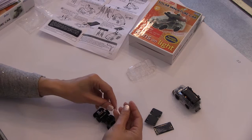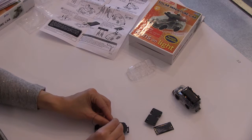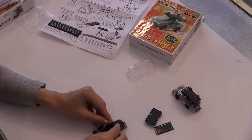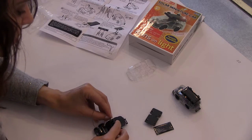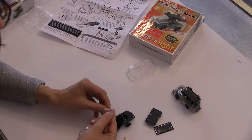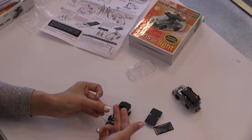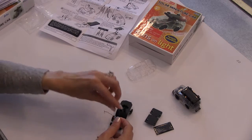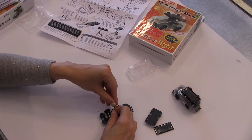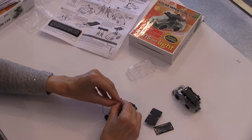So you're going to take the clip, and the longer end is going to go in the center, and they just go down into these pillars. But the wire needs to go, it's somewhat easier if you bend the wire part down. You make like a little hook to it, if that's visible. And that makes it easier to stick into the pillar. This seems to be the main problem: if it doesn't work, it's that the wire's not touching the right place.